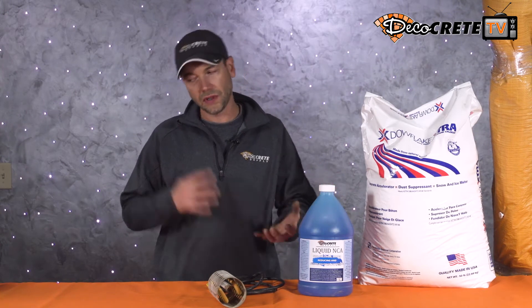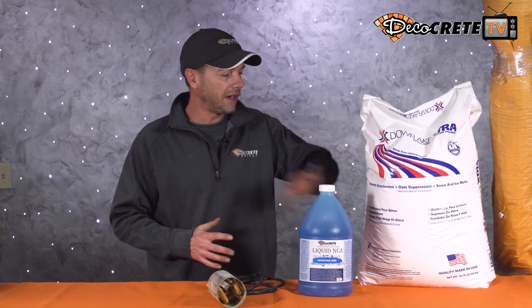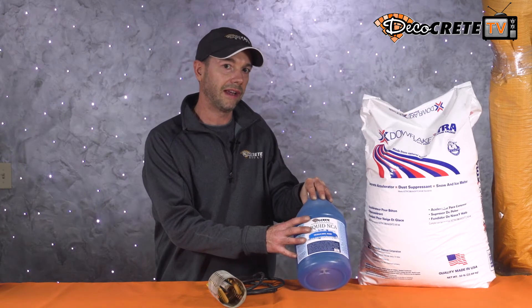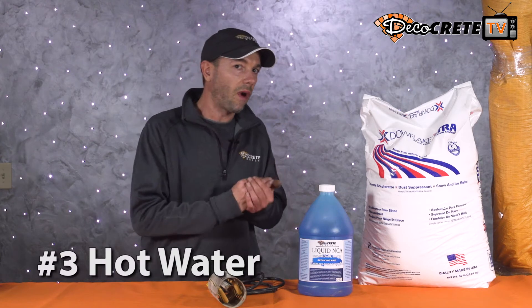The biggest thing when it comes to calcium flake versus non-chloride accelerator — we're talking about stamped concrete and any decorative concrete — it is not recommended to ever use calcium flake in decorative concrete. There are a lot of reasons: it's going to change the color of the concrete. Anyone who's poured calcium flake even with gray concrete knows it just never turns out as bright and it always has a more drab look. That's fine for a plain driveway, but for stamped colored concrete, we do not want to use calcium flake. We stick strictly to non-chloride accelerator. Two percent non-chloride will do what one percent calcium was going to do.